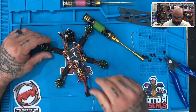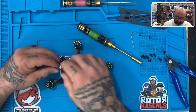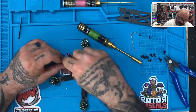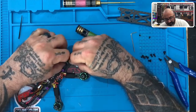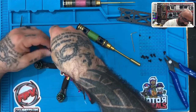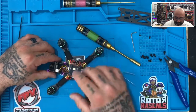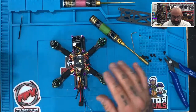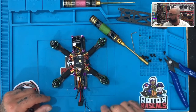For right now we're going to stop here and make sure everything looks just like this — you have your antenna ready, your wires back here, your XT30 here. I need to seat my camera back in. Once I seat it in, I may not tighten it down just yet because it may need some wiggle room when putting the top plate on. If you find it's popping out every time, you can tighten it just a little bit. Don't worry if it angles forward — once we tighten this, the camera angle will be perfect. The receiver is done, we've just got some final touches: putting the top on, wiring down the antennas, zip-tying those, and getting the camera in place.